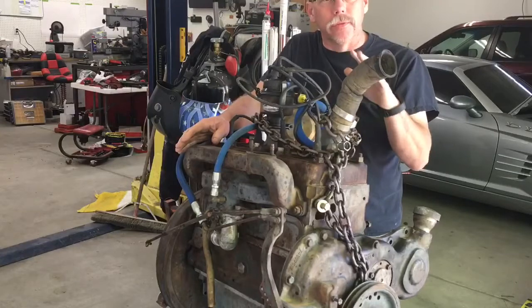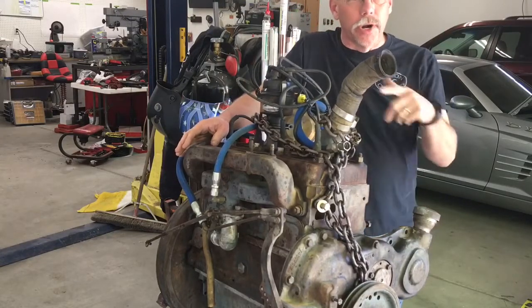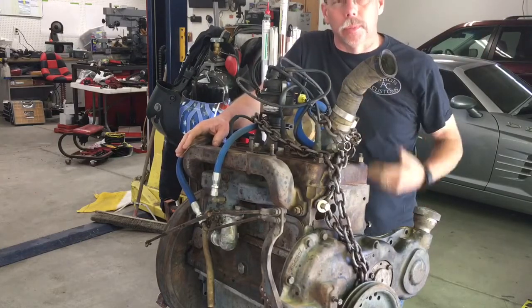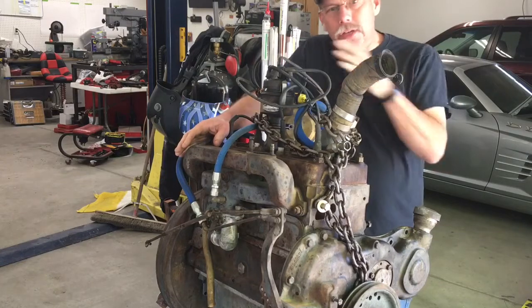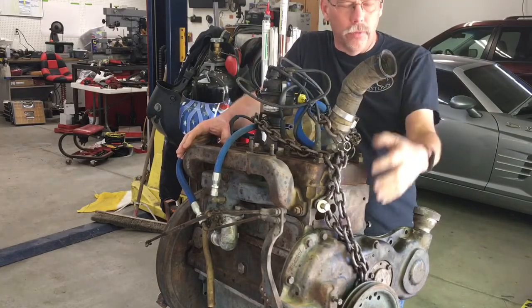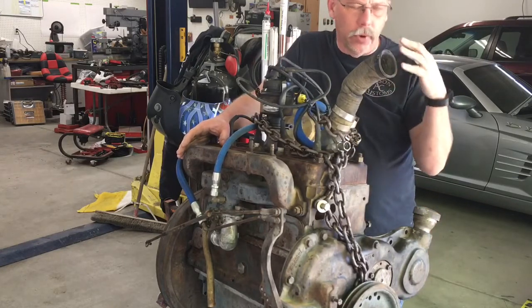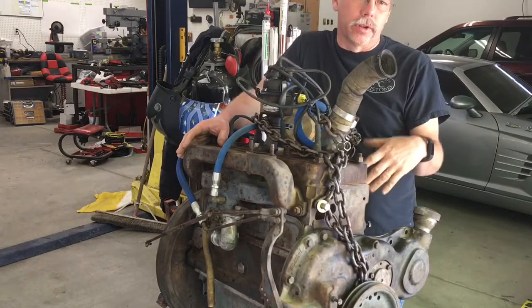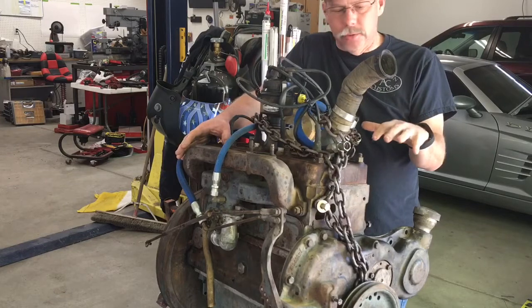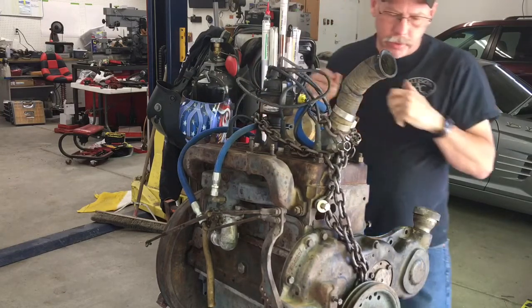Came out of my forklift, so I've got that old Clark forklift. Did a video a while back doing brakes on it, and I've had it now for going on about 2 years, and it leaks everything. So over the winter the water pump gave out, and so I've got a new water pump for it. And while I was doing that, the radiator needed some work, and so I took that in. And I decided I was gonna get rid of the oil leaks if I possibly could. So I pulled the motor, and it's pretty cool.